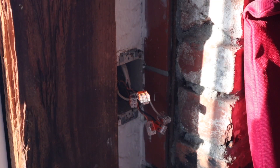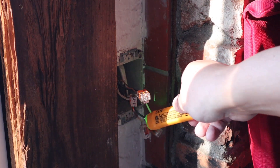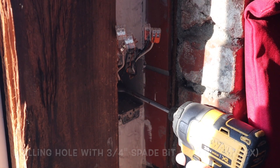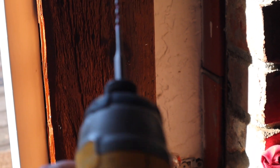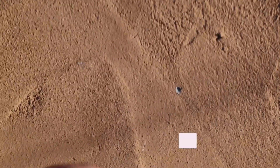I'm going to go turn the power back off now. Power is back off, just confirming. We now have a hole drilled — that gives me access to the stucco back. I'm now going to be drilling from the inside out with just a little thin masonry bit so that I can establish where the placement is for the box on the outside. We now drilled our hole from the inside out — worked perfectly.